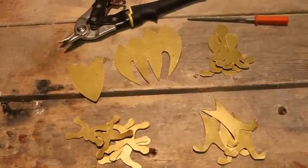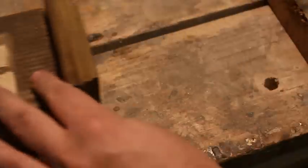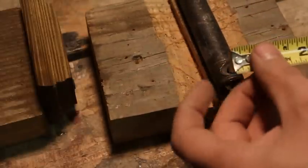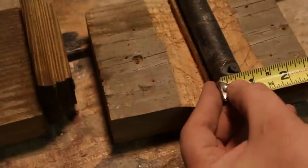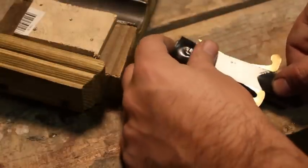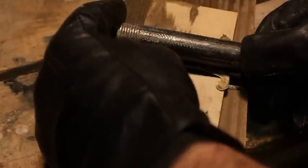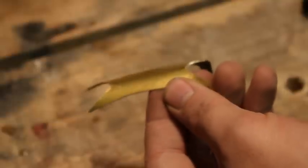Only 16 pieces this time. This is a jig I made for a former gauntlet video — one and one eighth outside diameter, and just a little under an inch inside diameter. We're only going to use one half of it though, so it's much easier for you to make. Just tape the pieces to another piece of pipe and push them into the half pipe here. It makes it much easier and a lot faster and it works pretty well. You may want to also tap it with a hammer once it's in there all the way to make sure that it takes the shape of the mold very well. Here's your part — looks pretty good.